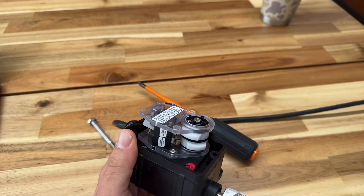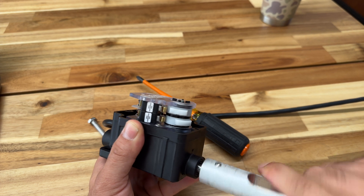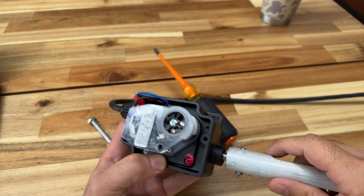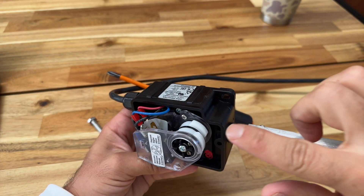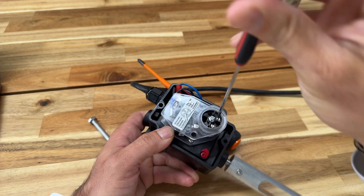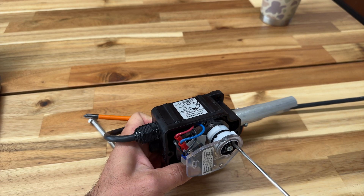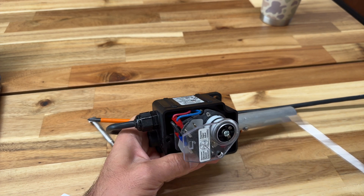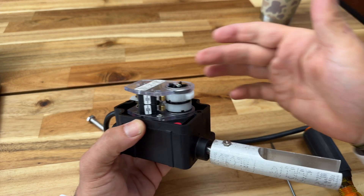Now take the boat all the way down. As you go down, the top rotor moves away from the contactor, and the bottom rotor does the same thing on the back side, eventually hitting the lower limit notch. Go to the second screw and advance it until it hits where you think the lower limit is. Set your boat to the lower limit, then turn the screw until it clicks. After both are set, put the set screw back in and you have both limit positions set.